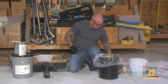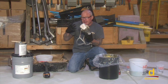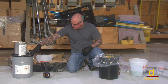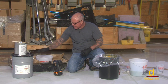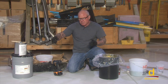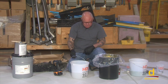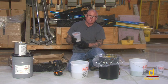There's our four ounces. Anytime you're working with these materials, it is really important that you wear an OSHA-approved respirator. Obviously, for the purpose of this video only, I can't talk while I have it on, so please adhere to your safety when using these types of products. The first thing we've done is taken the lid off of the Macrolix P12 and previously agitated it with a slow speed Jiffy mixer. The reason for that is when the product is sitting on the shelf or on a pallet, the solids tend to settle out, so we want to get a homogeneous mix. Since we've done that and we're working in a small area, we've decanted off exactly one gallon. So we have one gallon of the Macrolix P12, and we have our four ounces of the MMA hardener which we're going to mix into this volume.